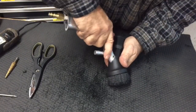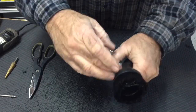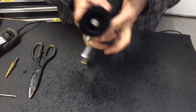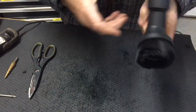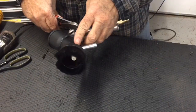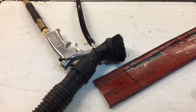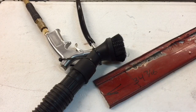This is a pretty snug fit, and it puts the nozzle about three-eighths of an inch below the hard plastic, letting me get some irregular surfaces with this brush. I'm going to take some tie wraps and maybe a hose clamp to hold these two together so it can be a one-handed operation. We've got everything assembled with our abrasive blaster and hooked up to the vacuum cleaner. I'm going to turn it on and try it on this piece of sheet metal — it's got automotive paint and rust on it and we'll see how it does.